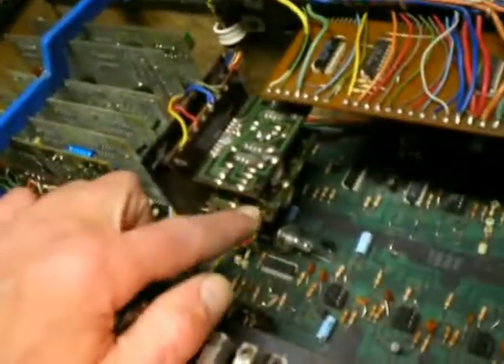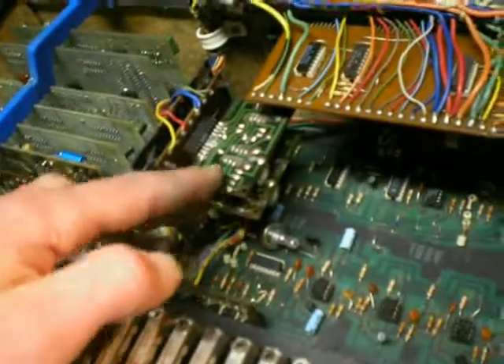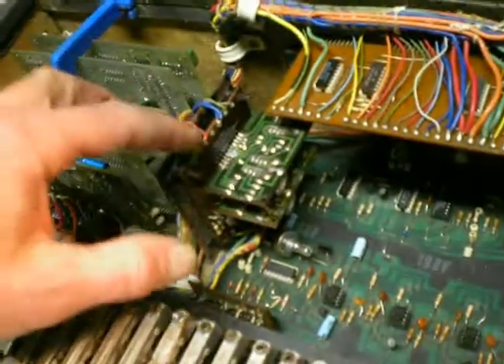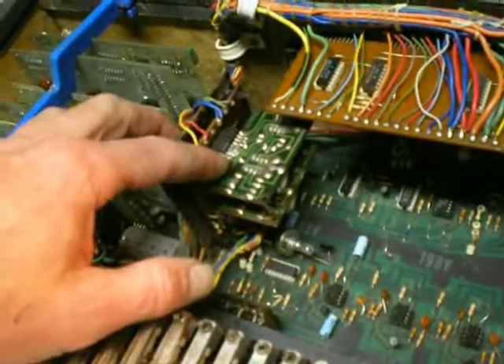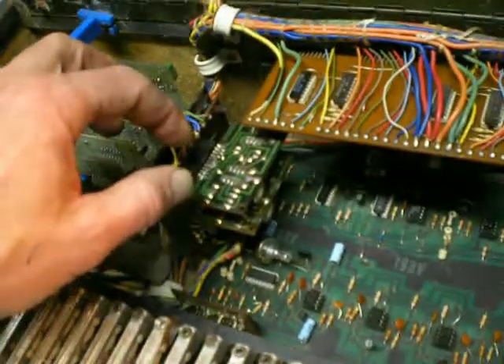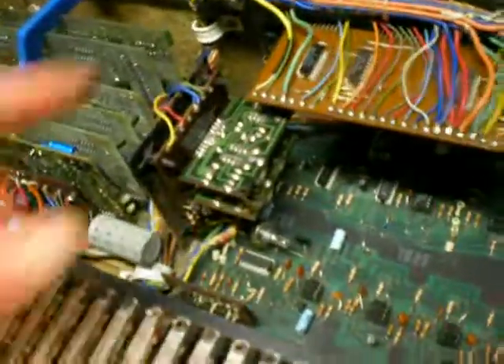This curious thing over here is actually your delay generator, and then a couple of OTA circuits — VCA circuits — one for each of the two low-frequency oscillators. This allows the LFO to gradually emerge. They come in here and come out a couple of other wires.